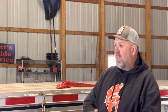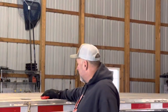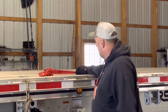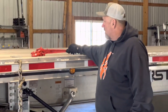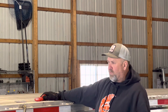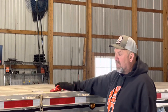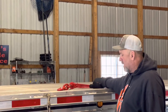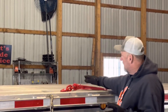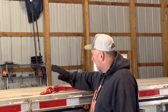There are three things in this chain system: you've got a chain, you've got a binder, and you've got where you hook it. They go by the weakest link. The binder — you don't have to really worry about these too much. This binder has a weight rating of 33,000 pounds, but you divide by two because you've got two ends with hooks, so it's about 15,000-something pounds working load limit on each end. In most cases, don't worry about your binder — it's going to be stronger than anything else in the system.